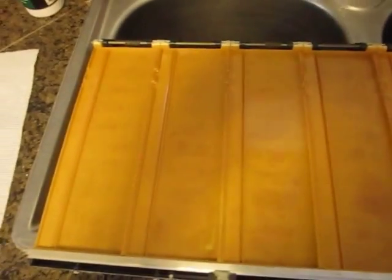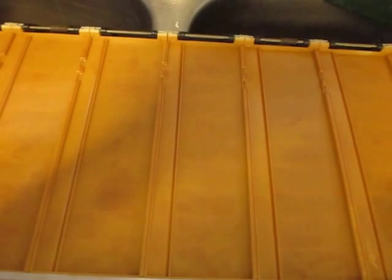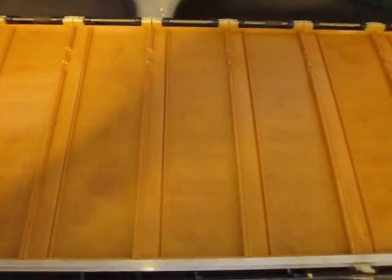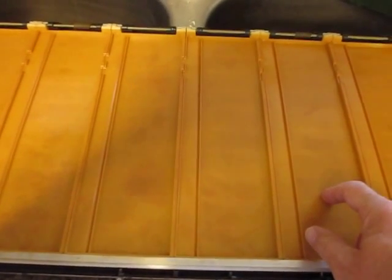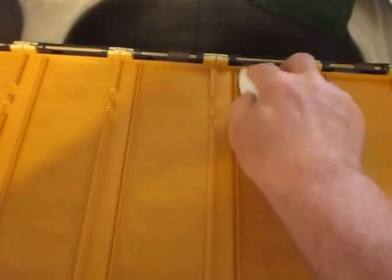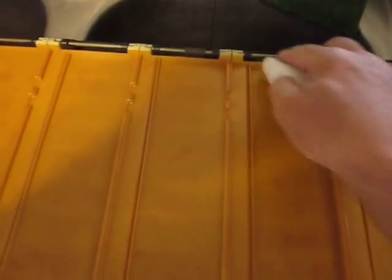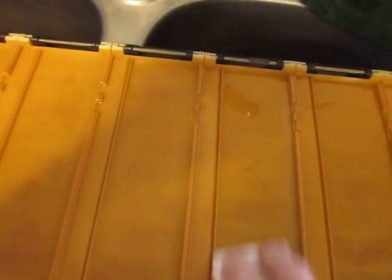I've got this sitting on top of my kitchen sink — it fits in there quite well. I wanted to see if the brown is from tar and nicotine stains from being in a bar, or if it's actually a change in the plastic due to UV lighting. I've got a magic eraser and some water, and if this is tar and nicotine it comes right off. So this is not due to tobacco use — this is true yellowing of the plastic itself.